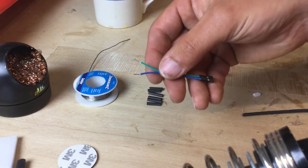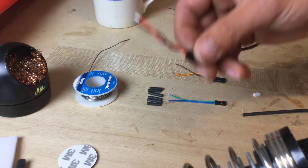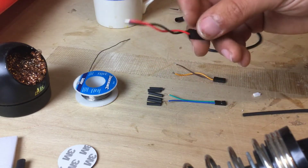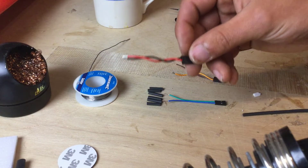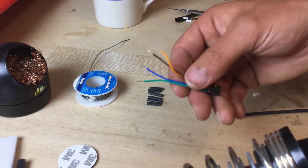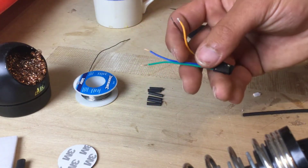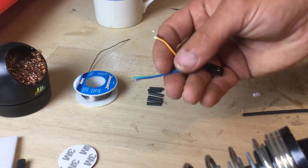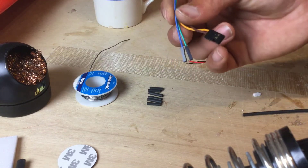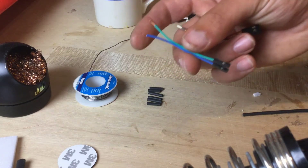Also I've got a blue and a green one. Color coding is completely unimportant except for the power, which is red and black — and you definitely do want to keep to red and black for that, because if you put those in the wrong way round you're going to get magic pixie smoke. If you put any of the other wires in the wrong way round, it just won't work but no smoke — so any color is fine for those. I've just gone with brown and yellow, and blue and green, and there are some dupont connectors which I've chopped up. If you've mucked around with an Arduino before you've probably got some of these cables kicking around — those would work fine.